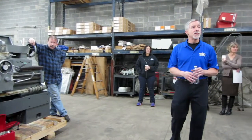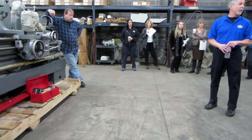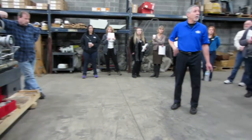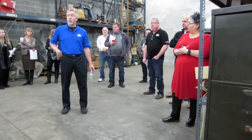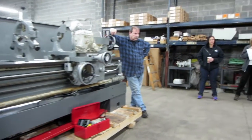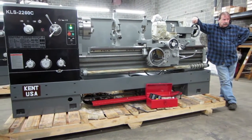So Phil, I know that in our line of lathes, the KBC lathe, we don't go up to this size. Could you tell us just a couple of the main reasons why Kent is a really good lathe? A little more support than we would give, since it's all on us anytime we're importing machines. But Kent has factories that won't sell to us, basically. Are they heavy machines? Oh yeah, they're heavy machines. There are other machines this size that are much lighter, not quite as structurally strong. There are some that match up on the surface as far as the specs go, but they have certain advantages. Nobody else offers a machine in this size range, in this price range for sure, with a clutch spindle drive. Everybody else is just hard start: you push the button and hope you've got enough electricity to get her turning.